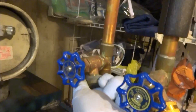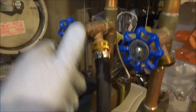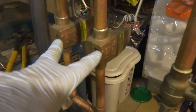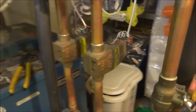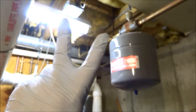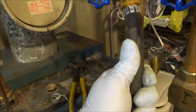This other one here has a cap on it — maybe it's leaking. I'm doing my last one here, last purge. These ball valves are off and these are acting like ball valves because they're not energized — these two zones on the supply. He's got a well here; not the greatest pressure, I'll tell you.